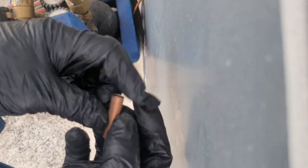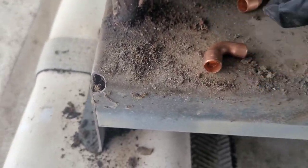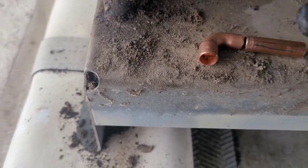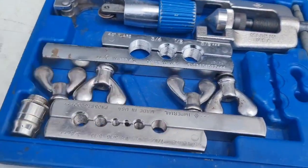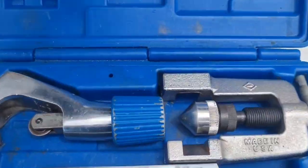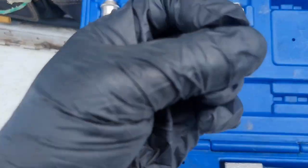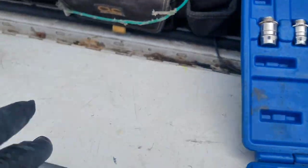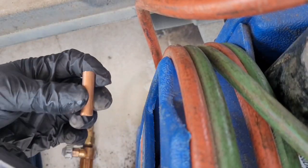A swage tool - I didn't know what it was before this year - it grabs onto the pipe and actually widens it to make a coupling end. The smaller side is going to slide into the coupling of that elbow, and this end will be a coupling that slides over that. If you don't know, this swage kit comes with these pieces and also does flaring, but it does great things with copper tubing - specifically it expands it so you can make couplings and fittings.